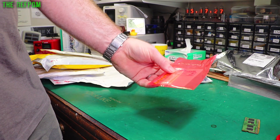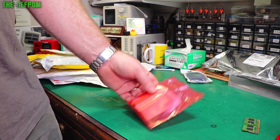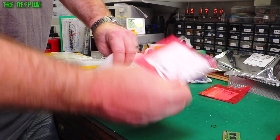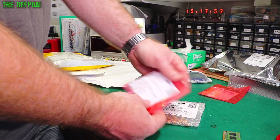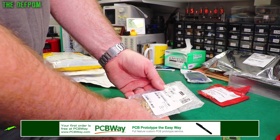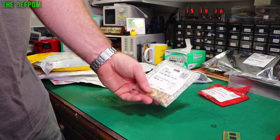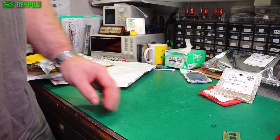Someone did post a list of capacitors the Datron uses and I've purchased those plus a few other random ones, just in case - there's no harm in having extra stock. I also have some more tantalum capacitors: 4.7 microfarad 35 volt, and 33 microfarad 35 volt. The original tantalums in the 4700 are 25 volt caps on 15 volt rails, so I'm upgrading to 35 volt and replacing them. There are quite a few tantalums in there, so that's going to be interesting.